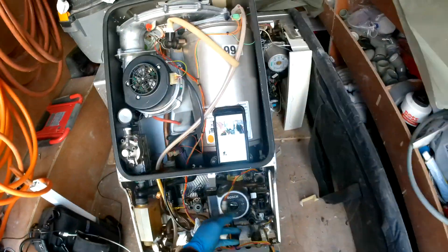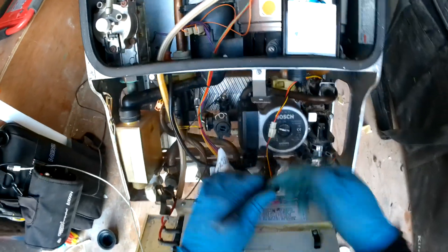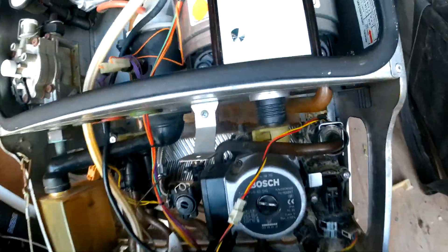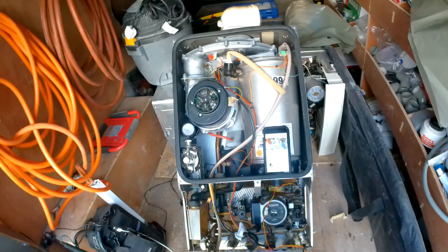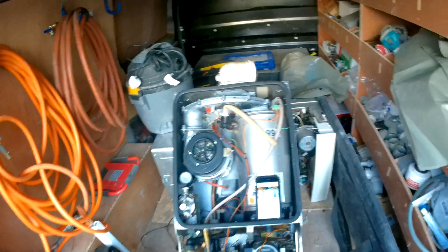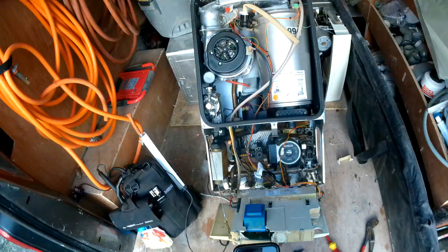Okay, that is that back in, connected electrically. We just need to do up the nut — tighten it by hand first, then get your spanner and tighten that up. Then obviously unisolate the cold water, make sure you've got no leaks, and then your new flow turbine should be okay. If you look in the description I'll put some reasons why you might need to change it in the first place. But that is pretty much it — put the panel up, put your case on, and you're done. That is changing the flow turbine on a Worcester Green Star Junior. Don't forget your cap — that will just go back on up there.